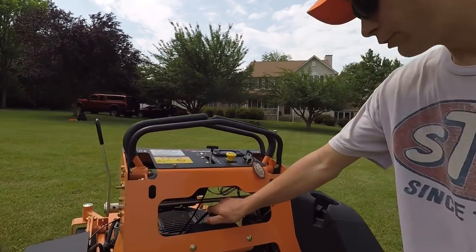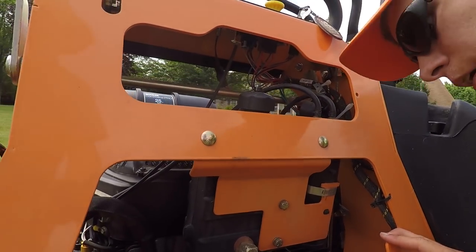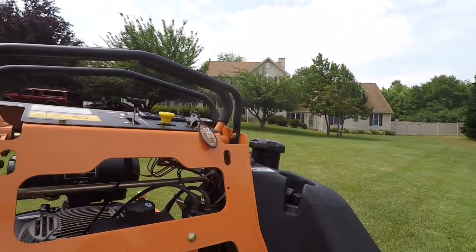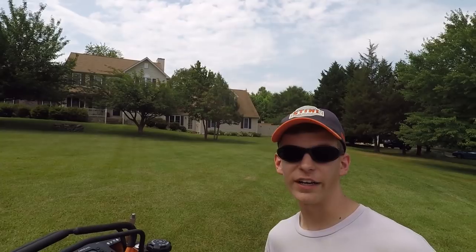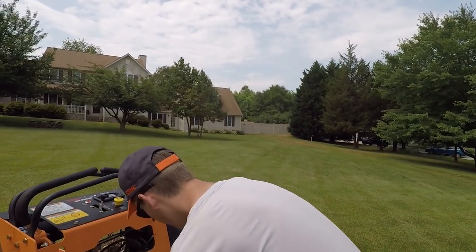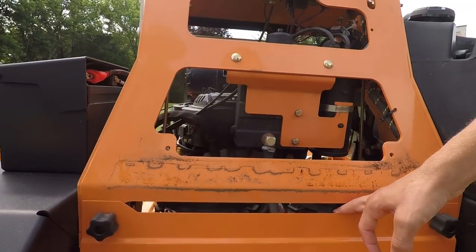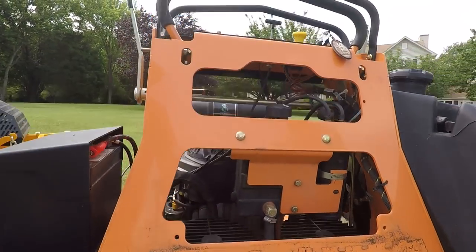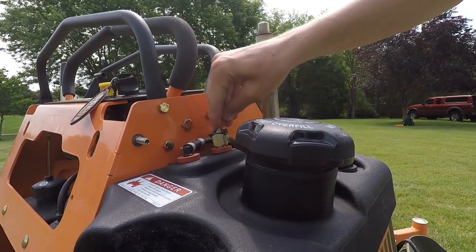You've got your oil fill here for your reservoir. I don't know where your hydraulic oil filter is. I don't see it in any clear place, but I'm sure it's either under the mower somewhere, or it could be somewhere that I'm not aware of. If you guys know, leave a comment down below. I'd love to know. I'm not super familiar with this mower. You've got two more rubber nuts right here to get this bottom panel off, and that gives you better access to your pumps in case you have to service those. You've got a nice big fuel filler neck, and you do have a fuel shutoff valve if you have to transport the mower.